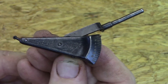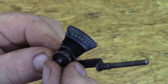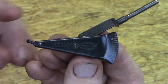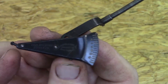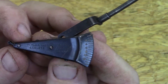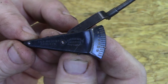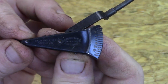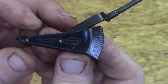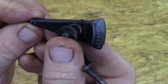One of the things that's really neat about this test indicator is it reads from both sides. It's 0 through 14 graduated thousands, and this indicator goes both directions without making any adjustments. If you push up on the stylus it reads 0 to 14, and if you push down on the stylus it reads the same thing — in both directions.